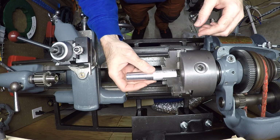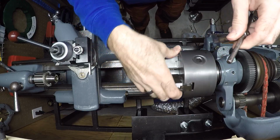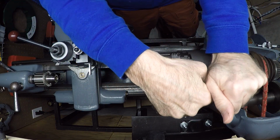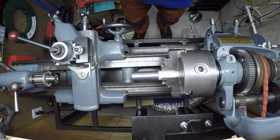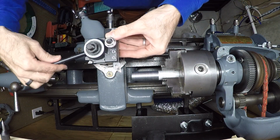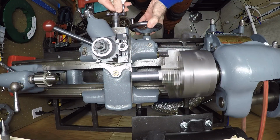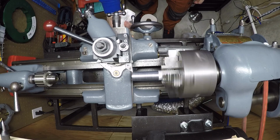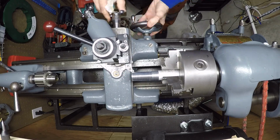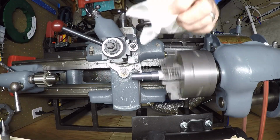The next problem I needed to solve was, how am I going to drill 2 3/4" holes in 3/8" plate? I don't have a bit that large, and even if I did, I'm quite certain my old Craftsman 150 drill press would be hard-pressed to get that job done. I considered using a plasma cutter, but again, that thickness with the small plasma cutter I have would yield less than desirable results. It occurred to me that although I can't drill a 19mm hole with my current tools, I can drill one at 9mm.